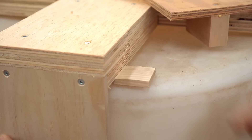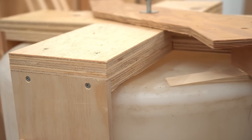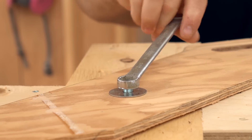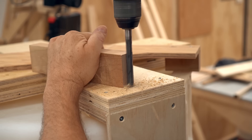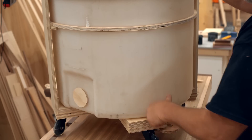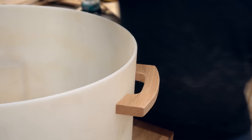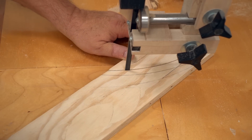That's this piece of plywood that has a handle that also has wedges that will rotate and lift the bucket up just enough to make it seal. This pivots on a 3/8-inch bolt that I'm going to lock in place with construction adhesive, and this doesn't get screwed all the way down — I'm leaving some space for the lift mechanism to drop down so that the bucket can be slid out. The bucket is kind of hard to grip so it needs a handle; I made a simple one and just screwed it on the side. Then I can make the inlet from scrap and recycled plywood, drill the hole through, and use it as a drilling guide to cut the hole in the cyclone ring.